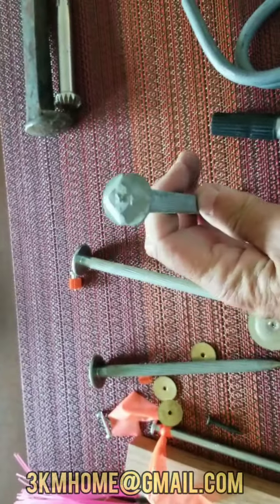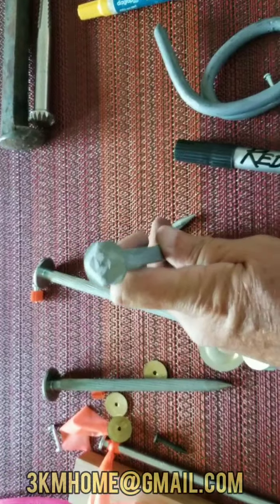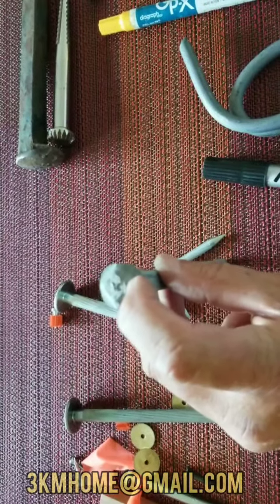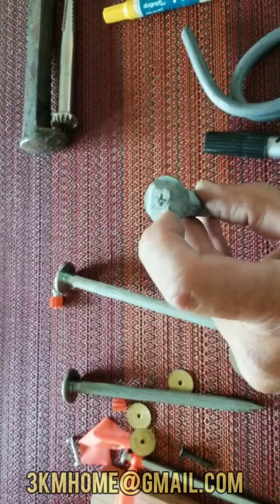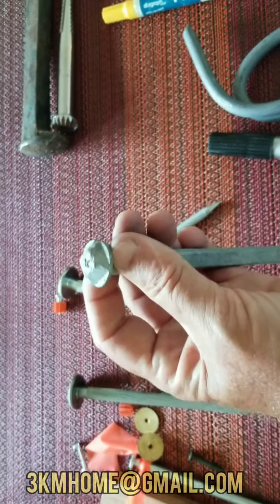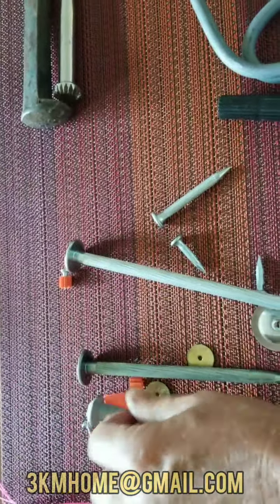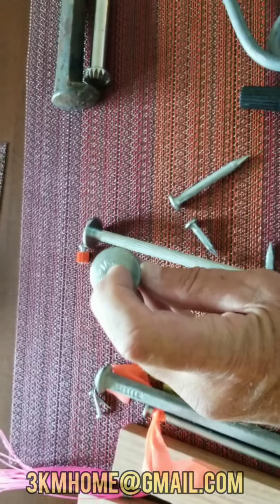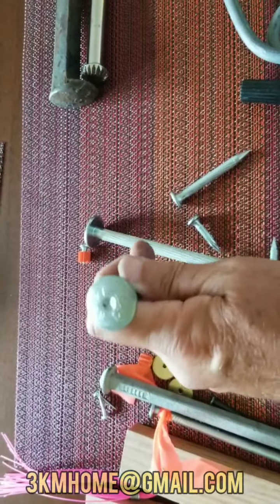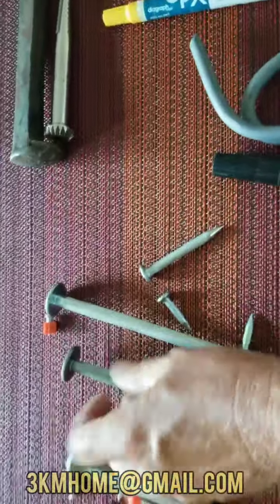What also counts as a spike are galvanized spikes. I like these sometimes because they don't have a punch on top — so let's say you're hammering it down and the point lands a little bit to the side, you can make a nice big punch right on the side. There are also brass caps where you have a large area to put the punch where you want it. Whereas with mag spikes, you can't really re-punch to get it in the center — that's why I like to drill the pilot hole first.